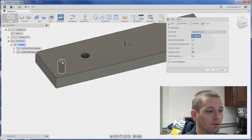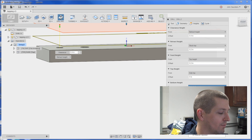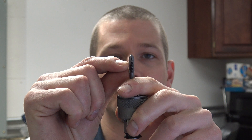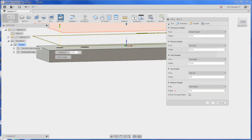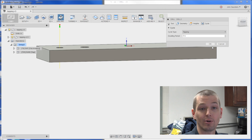For geometry I'll click my hole. Heights — hole bottom — we'll go a little bit past because taps don't always complete a full thread until about a quarter inch in. So we'll set drill tip to negative 0.25, and the cycle is set to tapping. I'm not even going to put a dwell in.